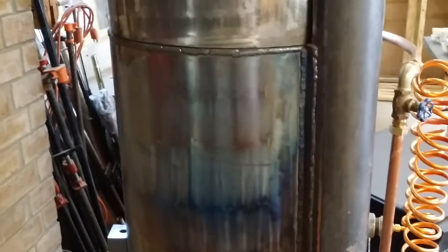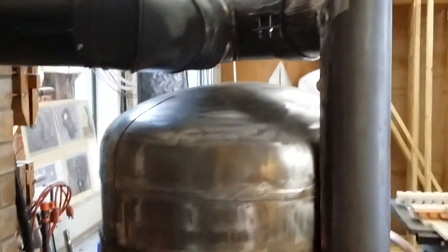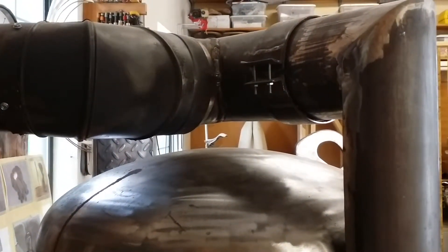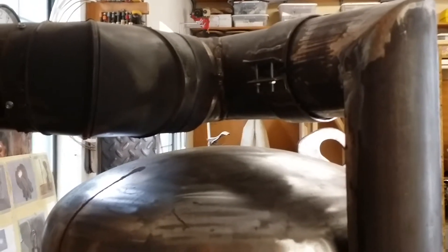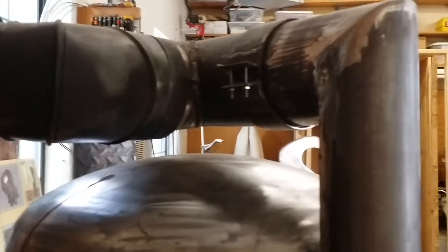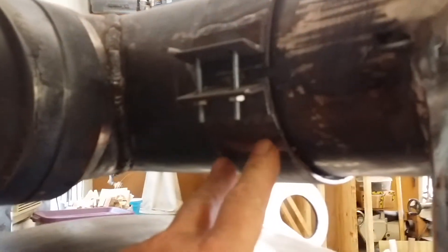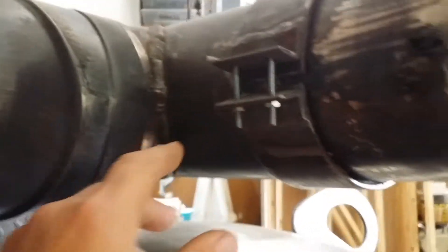She's a heating machine, as you can tell by the bluing. The top exhaust collar rotates so I can adapt it to inside a house with a flue pipe at the top or out the back. There's a double rope seal in this copper pipe — two rope seals in this flange pivot. This is my extra oxygen for the afterburn in the riser tube.